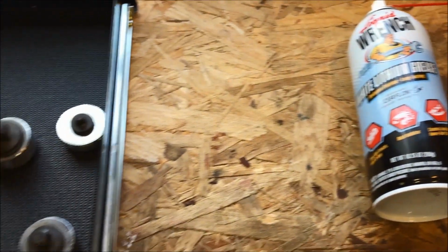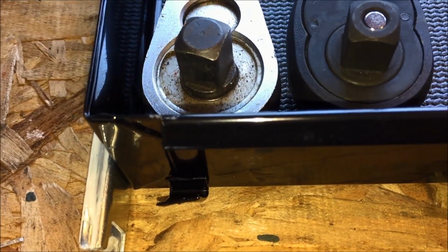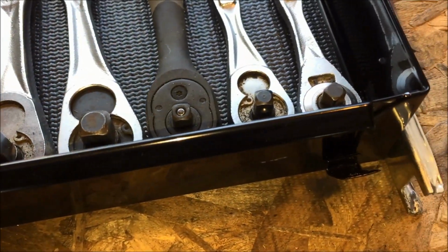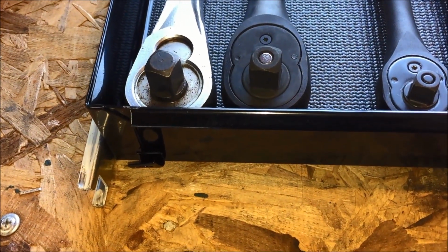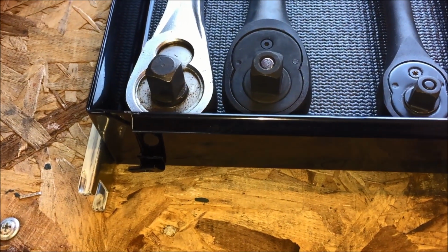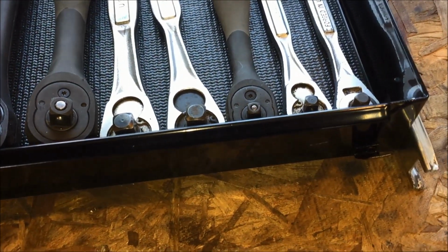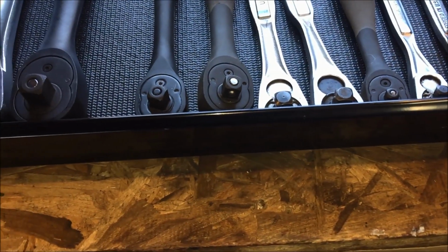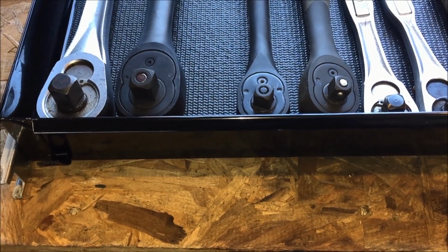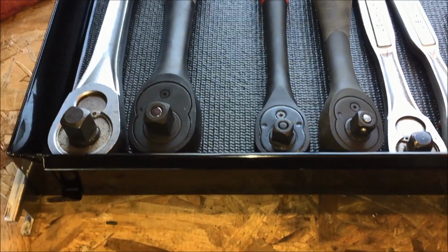As far as the drawer, there's the front of the drawer. If you look at the back of the drawer, there are two per side. There's one right there, and again, there's one right there. These are the two things that lock into those little rubber paws on the rail. As you can imagine, if those things are dry and the drawer closes on them, there's a lot of friction on that assembly, and that's what causes the increased effort to pull the drawers out of the slides. So why don't we go ahead and put everything back together and we'll do a little wrap up.